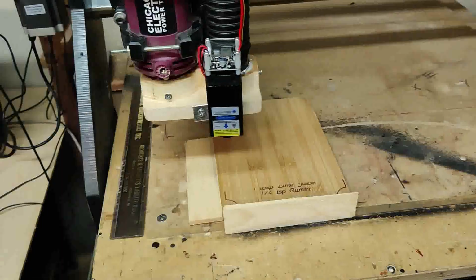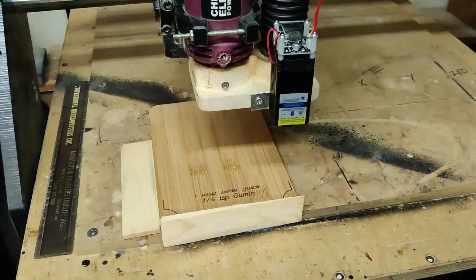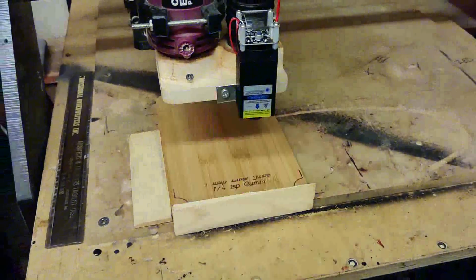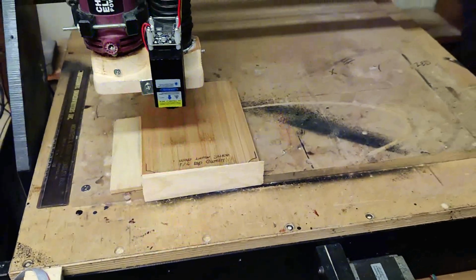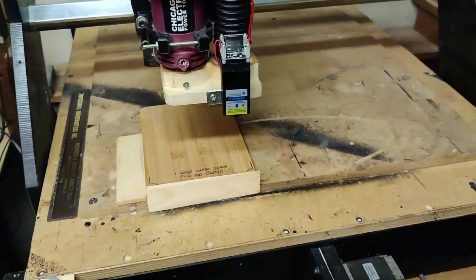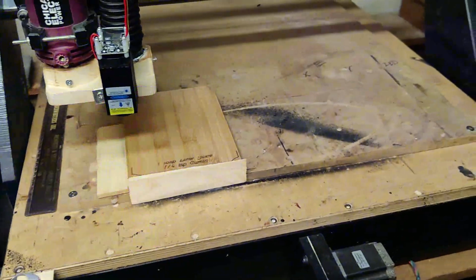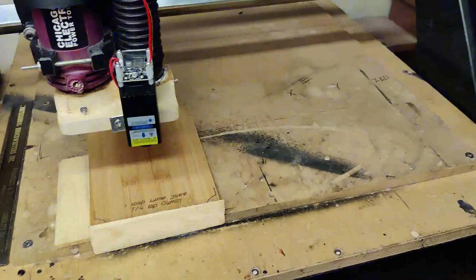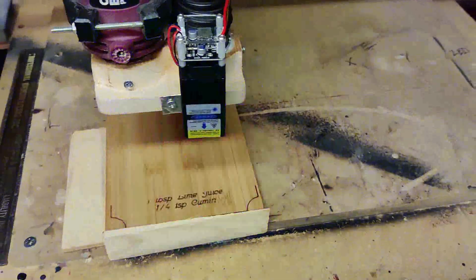So I turned down the planning setting just a little bit so that it gives it a little more time to make the decision on planning. Let's call it the jerk setting. It makes the machine less jerky, makes it run a little bit slower, but it's a trade-off. Either it jerks around like crazy and wiggles and does crazy stuff, or it does what you want it to do.